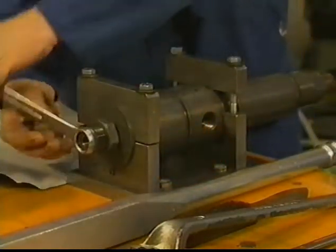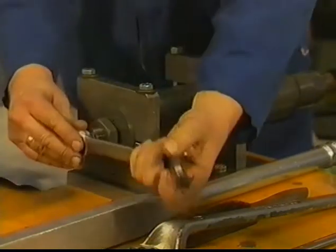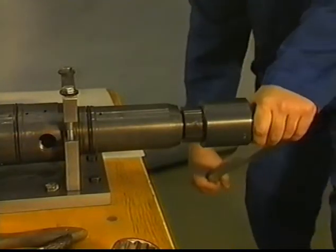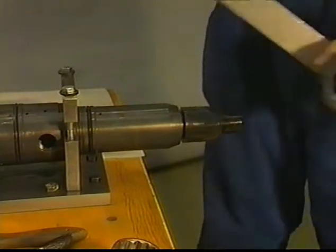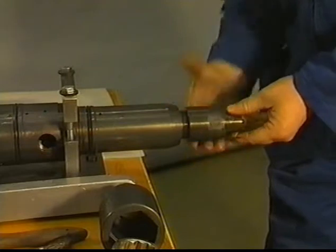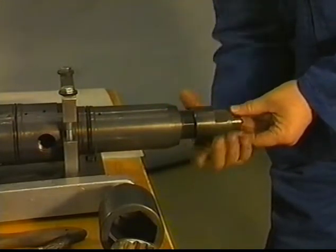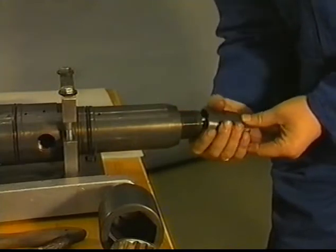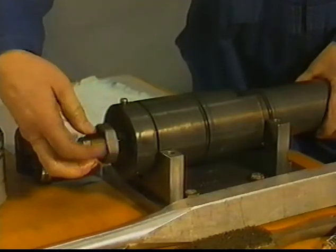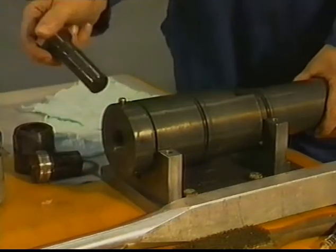Release the nozzle spring tension first. Remove the nozzle from the holder by turning off the sleeve nut. Use the special socket. Remove adjusting spindle, guiding rod, spring, and push rod.